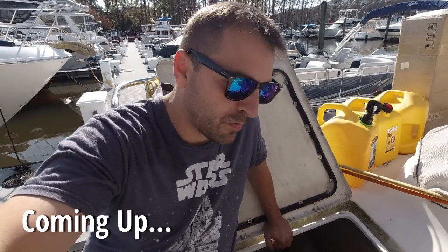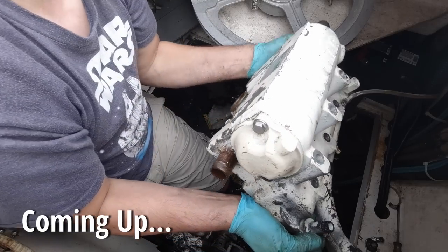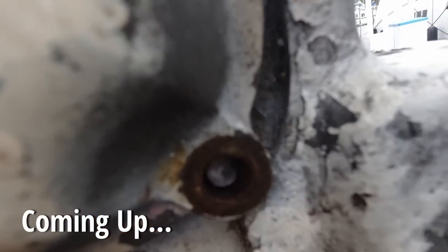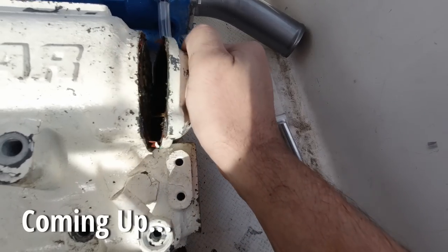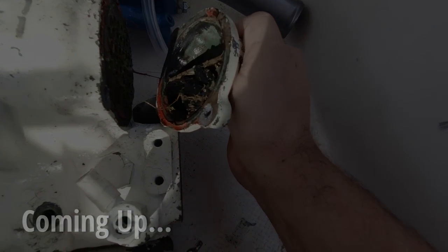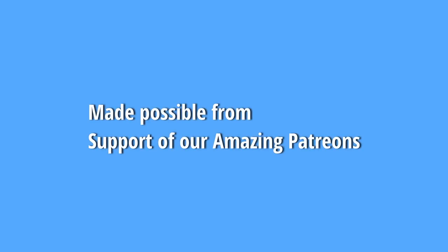That baby, it's not fixable. Right there — should have a head on it like this. We've got pinhole leaks that are going to go catastrophic if we don't handle it. Oh wow. See guys, this is exactly why you need to do service on your heat exchangers.